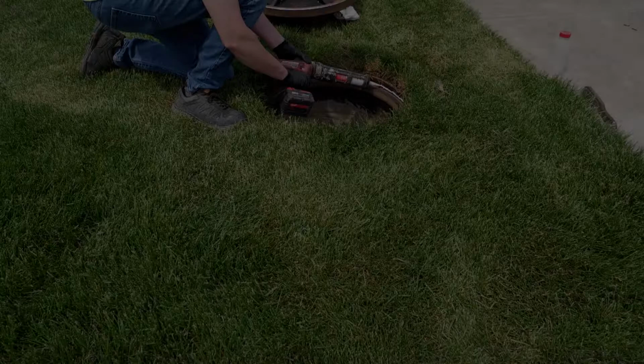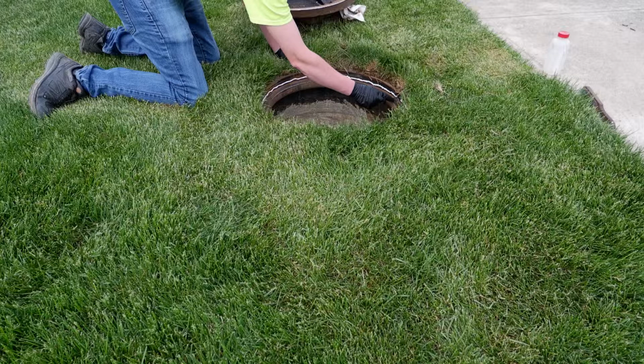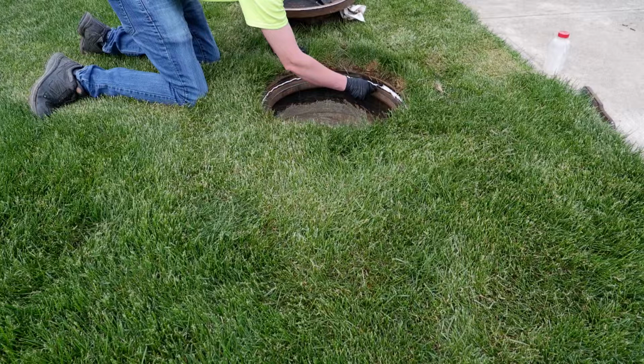Using a caulk gun, carefully apply a bead of adhesive around the wall of the frame. Additional beads and larger beads can be used if a large gap is present between the frame and cover. Using a small brush, spread the adhesive along the frame wall. Make sure the adhesive covers 3/4 of an inch up from the frame seat so that the entire backside of the rubber will adhere.